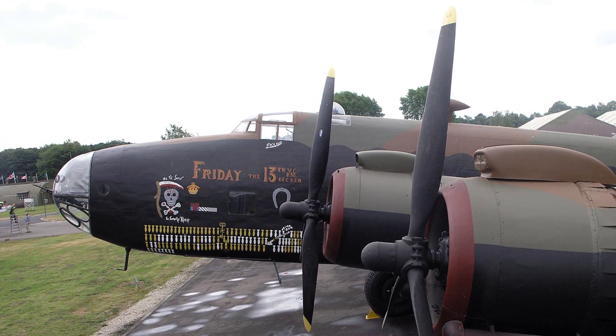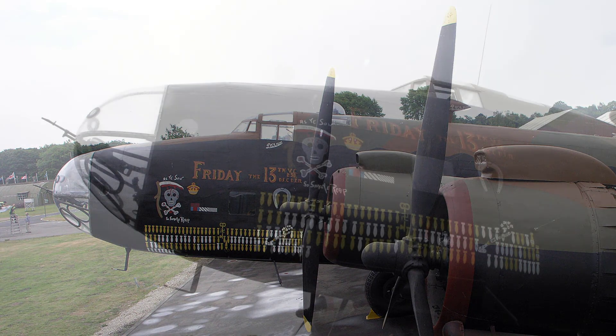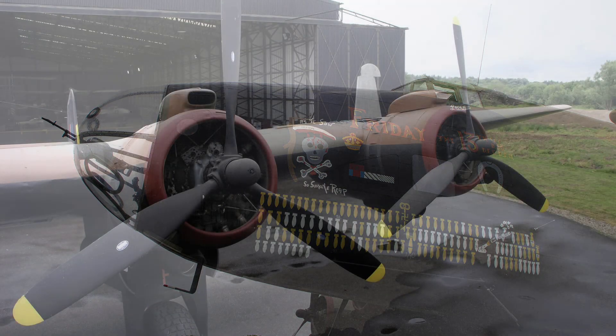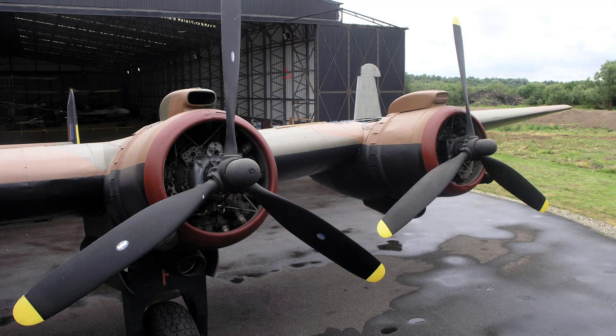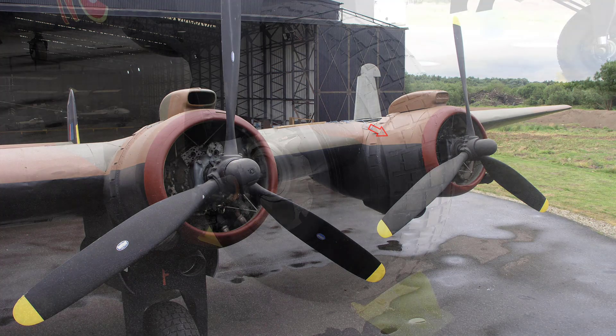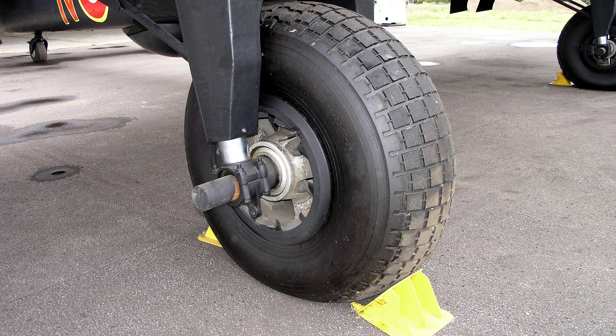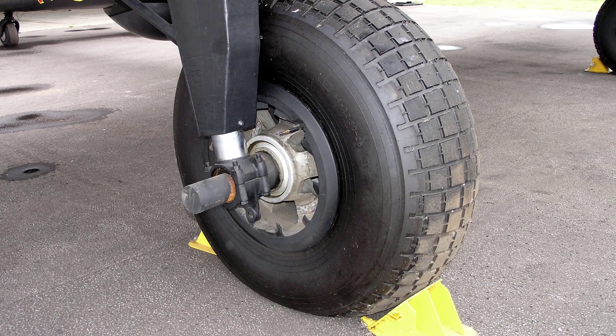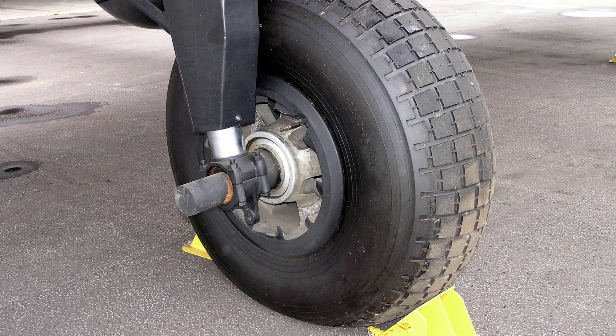We'll start with the required preliminaries. Before entering the aircraft, check that the engine, cockpit, and pitot head covers are off. Carry out a visual check for oil and fuel leaks and that engine cowlings are secure. Check tyres for cuts and creep, and undercarriage oleo legs for even compression. Check that the undercarriage accumulator pressure is at a minimum of 250 pounds per square inch.